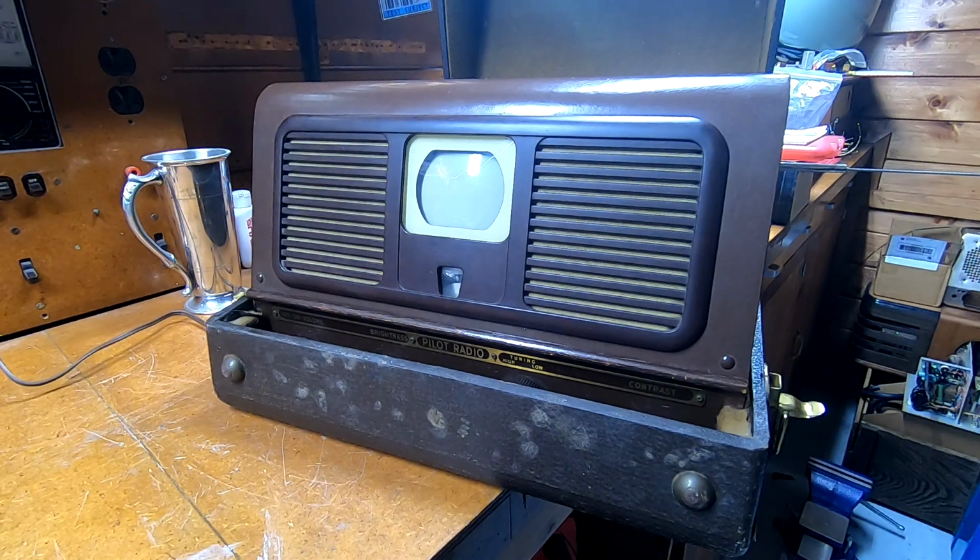And then my collector friend suggested, well, you're using a VCR for a signal source? That really isn't the best idea. I wasn't aware of this, but apparently a lot of VCRs have really poor quality RF modulators built into them. So the sync signals, the sync pulses at the end of the video information are not super uniform, I guess. Not really all that easy for the circuits in this thing to differentiate from the normal video signal itself. So it freaks out when they're not nicely defined pulses. So the general recommendation is drive it off of a DVD player or some other signal source.